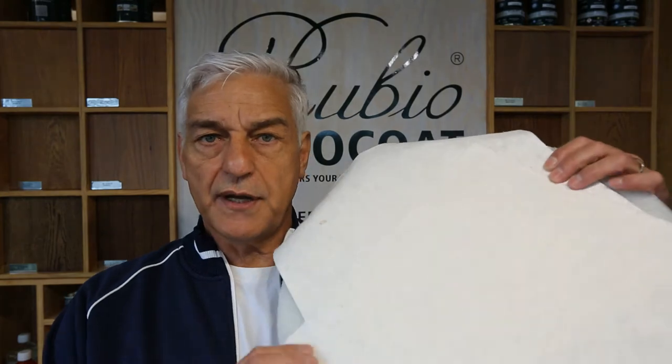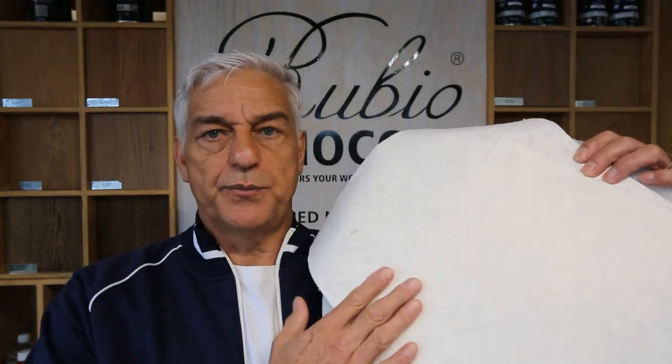So if you feel that you've applied a bit too much on the floor, you can use cloths on the white pad to remove the surplus. This will take off the surplus, leaving a touch dry surface which you can walk on. Actually, 48 hours that's going to be dry, and 1 week later it'll be fully cured. You are then able to cover the floor with paper. Rather use cardboard or a paper solution on top of the floor. That will allow the other trades to come in, if it's a tight project, to walk on the floor and use the space for other trades such as curtains and kitchen applications, etc.